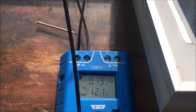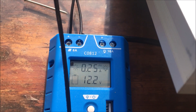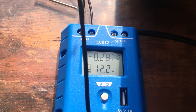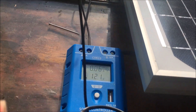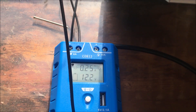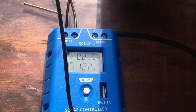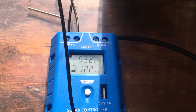The sun input isn't super strong. I just lifted the panel up so more of it is in direct light — and that's working. With it lifted higher, we're at 0.32 amps. It all depends on angle. When laying flat we dropped to 0.06; tilting it towards the sun gets us 0.25 to 0.32 amps. You could find that perfect sweet spot for best voltage. Look — we're at 12.2 volts late in the day.